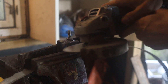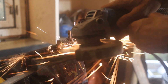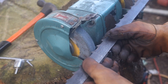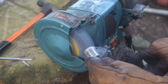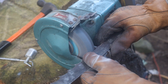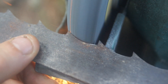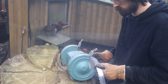I'm sort of an idiot that didn't think far enough ahead, so here we're cutting a slit to get the blade back out. Now we have to resharpen the teeth, so the plan is to shape the grinding wheel to the tooth profile. I'm just using a broken diamond drill, but any scrap diamond tool will do. When you have the right outline, it's just about touching off on a tooth and then rolling back over the next one.